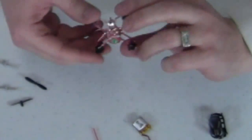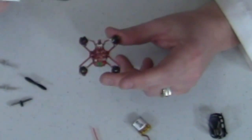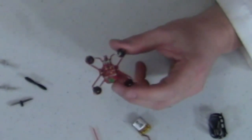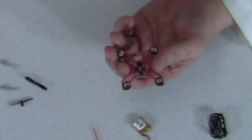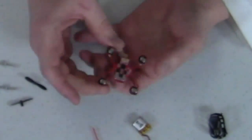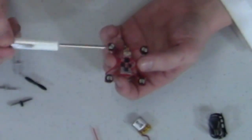That leaves us with the motor mounts and the bare board. The board is populated with a two-side configuration. The bottom side has the regulating transistors as well as the crystal for maintaining time and the on-off switch. On the top side of the board, underneath the lithium polymer battery, you'll find some number of ICs. On this one we have four visible — the largest one being most likely the microcontroller which will handle the input.